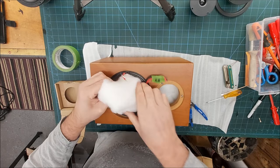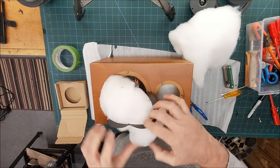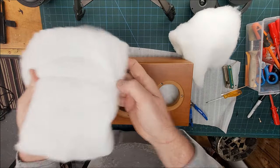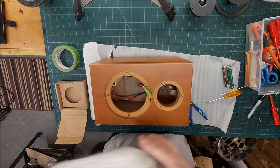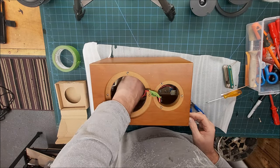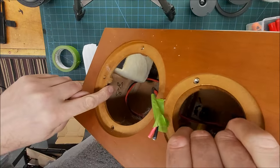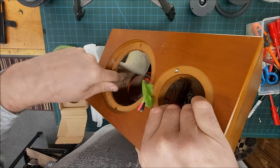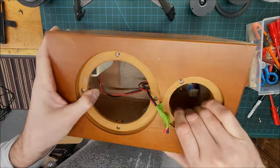Cabinet fill — we've got a good amount of polyfill stuffed in there. We'll take our woofer gasket off — we don't want to break that. There are a few pieces of fill material, and a big lump on the back panel — I can only imagine it's there to dampen it. The bass reflex port comes through, and we've got kind of almost a filter over it, probably just to slow the air movement down and stop any port noise.